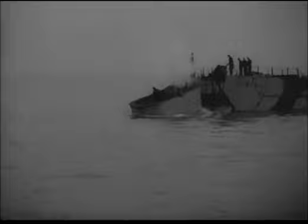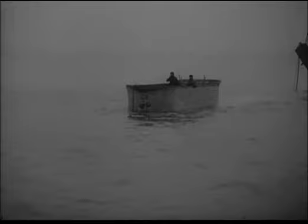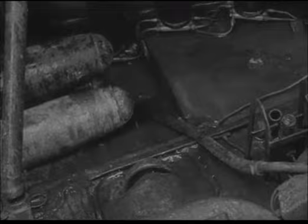The total weight of the Sherman tank is 34 tons. Immediately the tank is waterborne, the commander orders the driver to lower the propellers and engage third gear. If any water is shipped or seeps inside the screen or hull, it's cleared out by a bilge pump. The entire tank is below the waterline, which is approximately level with the top of the turret.